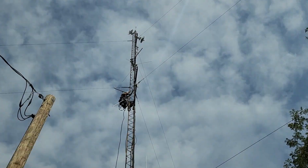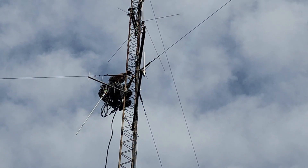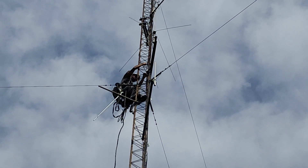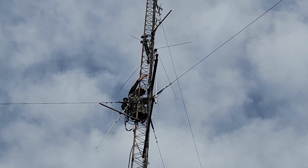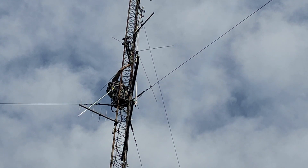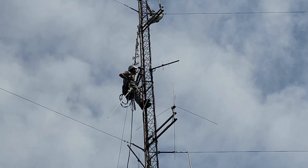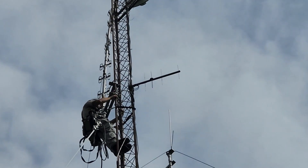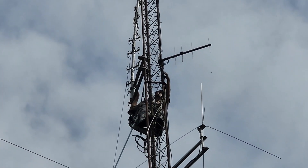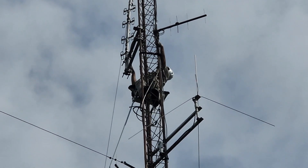Ken has made his way up about halfway. There's another antenna on this tower — that's where we installed the DMR equipment at our location, and N1DTA helped install the antenna for that. It's a very nice antenna, but the storm we mentioned a little while ago moved the arm that it's on, swung it over, and it hit the guy line. So the DMR has not been working very well either. Ken is going to move that arm, loosen it up a little bit, and move it back away from the tower to get that antenna more properly positioned.